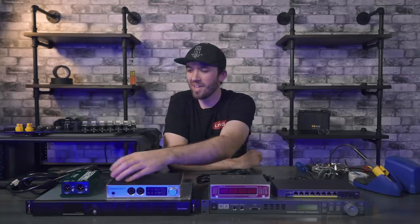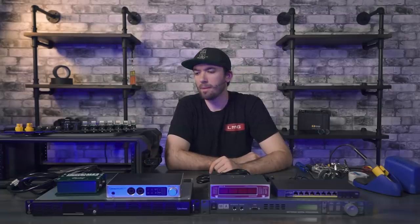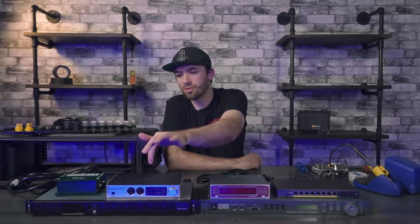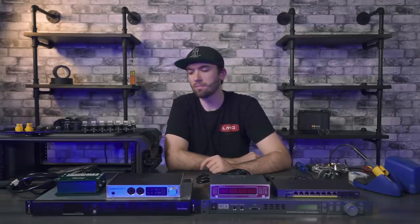Next most interesting probably be this passive radial mic level splitter. That's just for our second or our first timecode input, actually, just because I need to have a split to go into both this unit here, which is our audio card, and then hop out to an MA, since if we have two timecode slots running, we can only have one MIDI timecode input in the onPC session. I'll explain a little bit more about that in probably a different video. But I need this to split out to another output, which would then go to the MA.